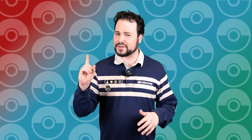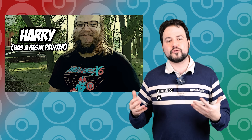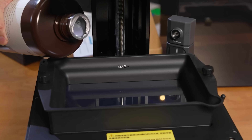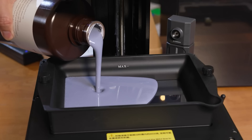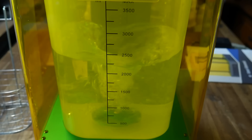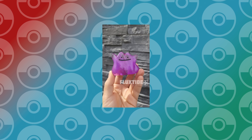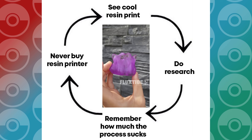But I eventually realized there was still one specific printing need I had. If you watch this channel, you probably know that sometimes I need a clear resin print. And while I've paid my friend Harry to help out when needed, I've realized that at some point I'm going to need to start doing these prints myself. Resin printing is an entirely different ballgame than the plastic-melting FDM printing I'm used to. With resin prints, you have a vat of messy and toxic resin that flash-cures the print layer by layer with UV light blasted from an LCD screen. If you're lucky enough to get a successful print, then you need to wash it in isopropyl alcohol and finish the curing process with more external UV light. The resin is expensive, the LCD screens have a limited life, it's messy, sticky, gets everywhere, toxic to touch, toxic to breathe in — it's a nightmare.